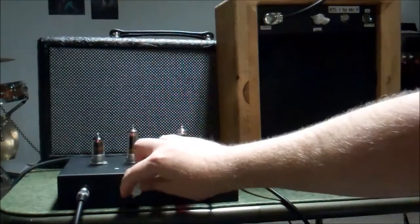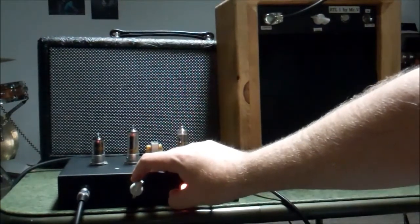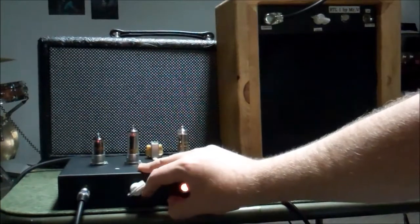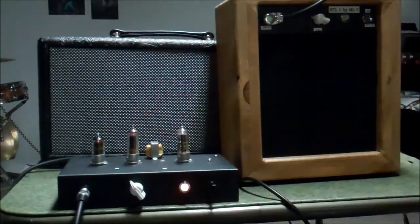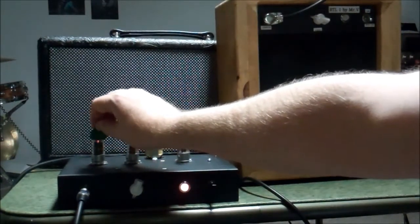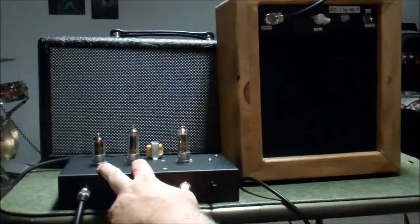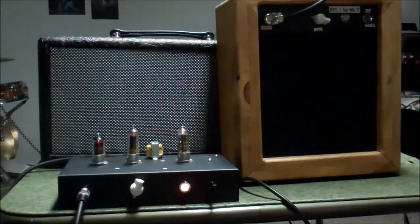The volume in this thing goes before the tube. So you come: input, volume, first tube. If you turn the volume down to zero, it's absolutely quiet with just a very minimal amount of humming. But when you turn it up, you get some radio-ish noise that I've got to chase down. This pentode is always on full bore. Even with the volume at zero, if I give her a little tap, you can hear just a smidgen of what it sounds like when you tap on a tube that's cranked up full bore. Both of these tubes are always dimed — always working as hard as they possibly can. Your volume knob is just: what do you feed this tube? That makes this amplifier a bit difficult to denoise because it's always turned up to the maximum.